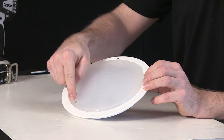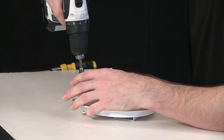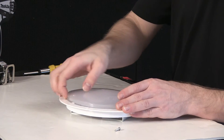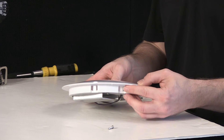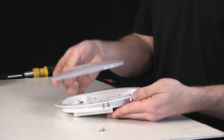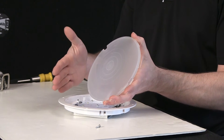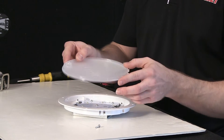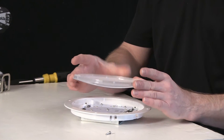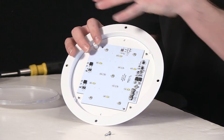On the front of the unit, there's one screw here — I'll go ahead and remove that. With that, it'll free up the optic dome on the front. Go ahead and lift it up. On the side, there's a set of tabs that lock the dome into place, so give it a slight lift, press the tab in, and it'll release. As I mentioned, it is an optic dome — a little different because it's a rounded optic versus those lines that you'll usually see in your light heads. Rough on the inside with the optics, and you can see the beveling of the dome itself.